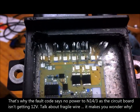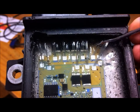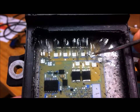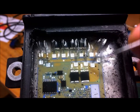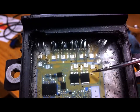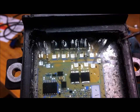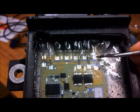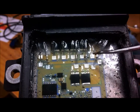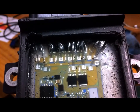So what we have to do is replace these three wires — very simple to do. We just have to cut the material out here to expose this corner, make a cut down there and across there, and pull this silicone or polyurethane out. And then we have to file those three pads to remove the coating off them.